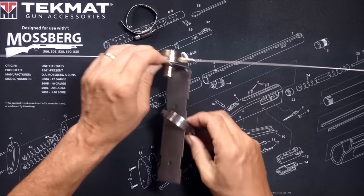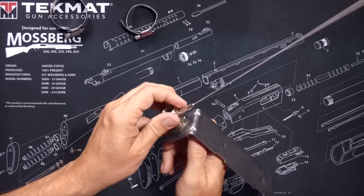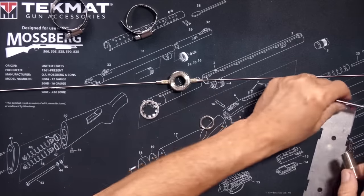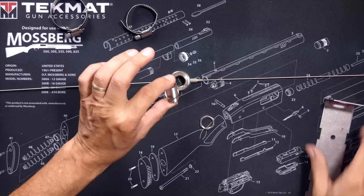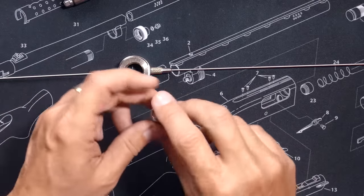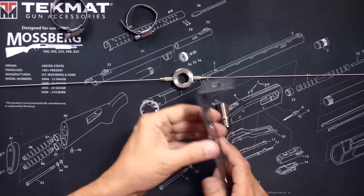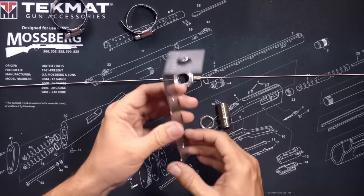This kit was made to be mounted on a mast, and you can use the clamps to secure the bracket to the mast. But you can easily remove the mount from the bracket and mount just the stud without the bracket on something like the flat fiberglass roof of your Jeep or motorhome, if you're willing to drill a hole big enough through the roof. Or you could leave it all on the bracket and mount it on a 2x4 in your attic or nail it to the side of your house.